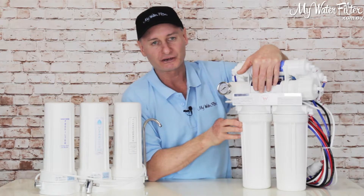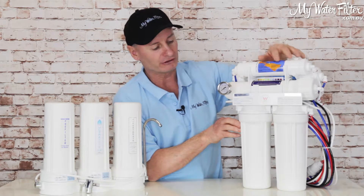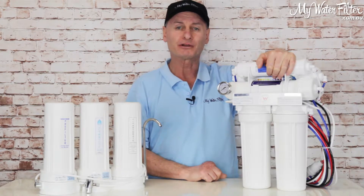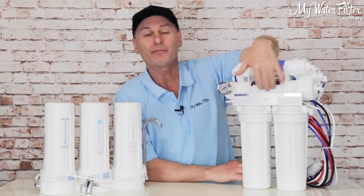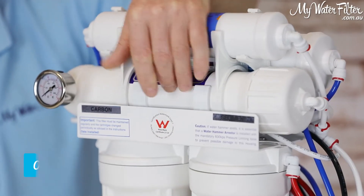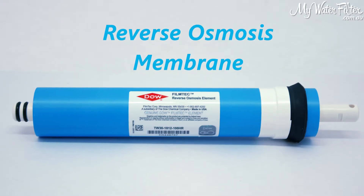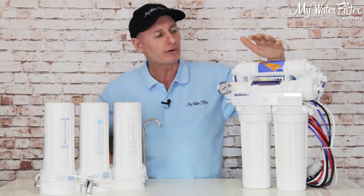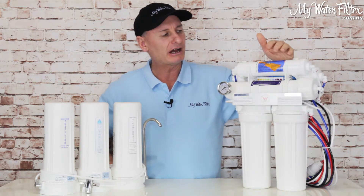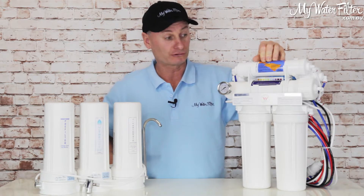Now when the water gets out of those cartridges, if you're in the city, unfortunately it's not the best it can be — and I'll promise you that. The cartridges in the bottom are five micron, but this membrane on top filters down to 0.0001 micron — so no virus, nothing gets through. This membrane is splitting the water; this filter does use some water in a roughly 50-50 scenario, with some going down the waste line, but that waste water carries all the contamination you're not drinking.